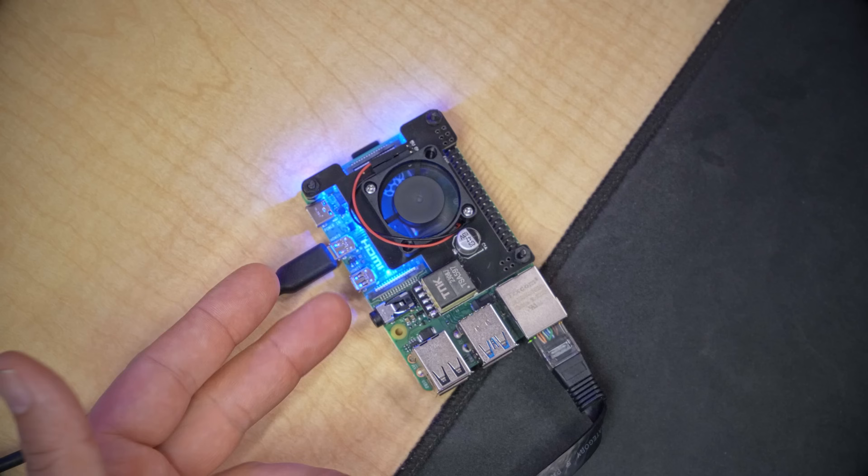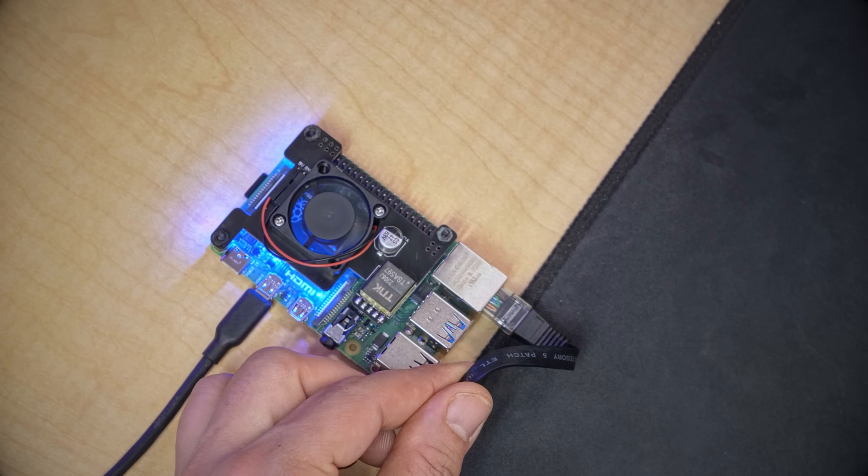But for the Goggles 2, only Cosmo Streamer can do this today as far as I know. And it's worth keeping in mind that Cosmo Streamer has additional functionality — it can output video over HDMI, but it can also stream video over Wi-Fi or over an Ethernet jack. So if you're trying to do some kind of big event where you need network streaming, Cosmo Streamer is pretty full featured. But for just a simple hobbyist who just wants to get HDMI out, maybe it's overkill. I'm about to bite the bullet and buy this license because I asked Cosmo Streamer for a free license, waited to the last minute, and they haven't answered me.